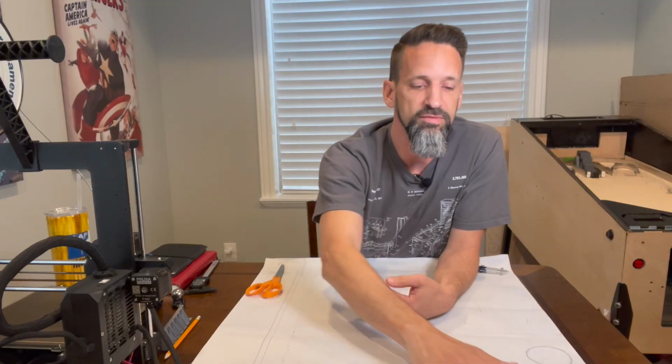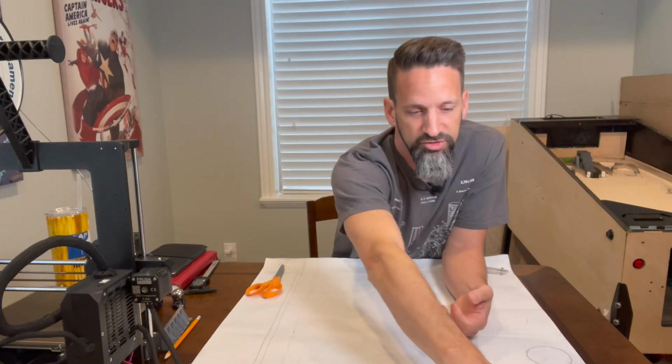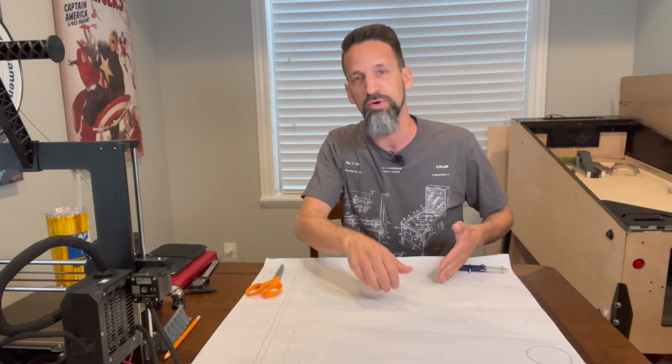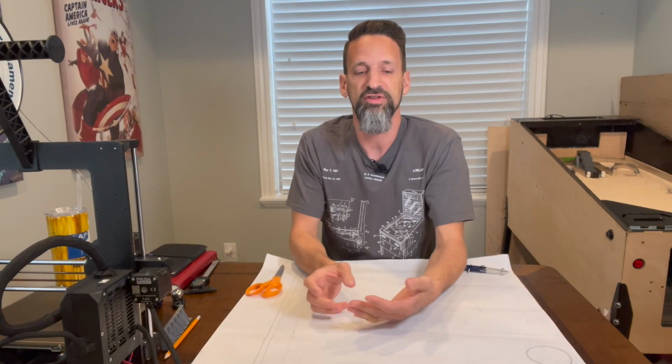The important thing really has to do with the entrance of each of those shots. The reason why a fan layout works so well is because of how those shots lay out and line up with the flippers down below. From your right flipper, you have a clear shot into each of these 3 shots on the left up top. Both flippers can usually hit the center shots, and then the left flipper can hit all these shots from the right. And so the ball usually has a pretty direct entrance into them, which is important if you want to make sure the ball is able to continue uninterrupted and keep its momentum and not have a lot of bricks and a lot of unintended ricochets, right?